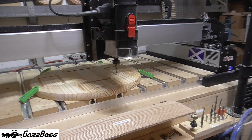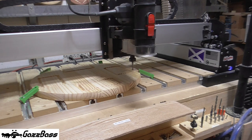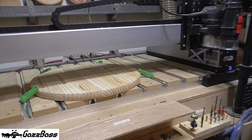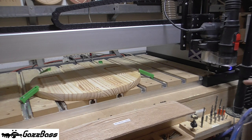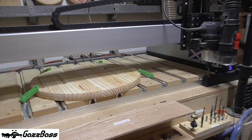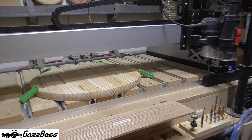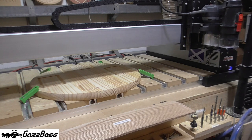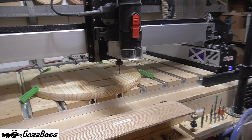Let's resume the operation. The machine is now going to go and measure the tool. That's it being precisely zeroed in height — the actual tool length protruding from the collet and chuck is being measured right now. For this part I'm definitely going to need to put the dust shoe on, so I'm going to go do that.